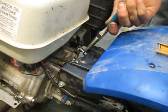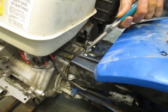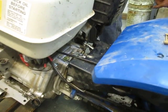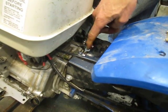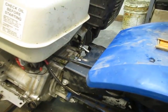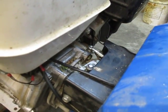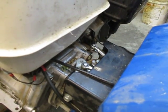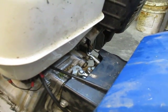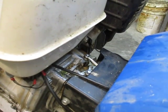I could repeat that test with the other cable but it would look just the same — you want the eyelet to be able to go just past it. Even if you just do the wiggle test, if you've got some slack in these cables, you're pretty good. Not super amounts of slack where the cables aren't doing what they're supposed to do — they have to be able to move those levers enough. If the cable on your black lever is too slack, it's not going to pull down far enough to pull the red lever back over the center point.